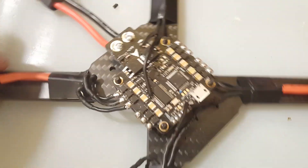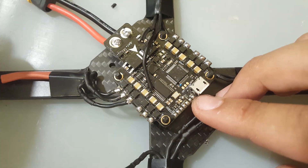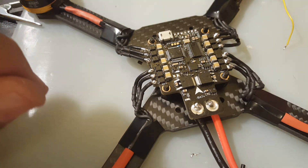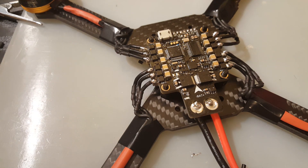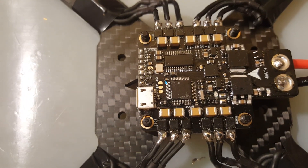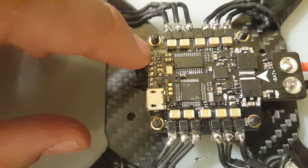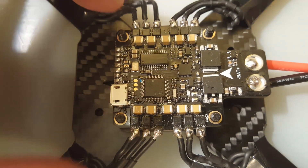I'll skip over the rest and be right back. When I come back we're going to add the camera wires, the receiver, a low-ESR capacitor, and set up the VTX wiring. Everything is now soldered on and looking clean. Starting with the camera — on the FC pads we have: ground, S.Bus, 5V for the receiver; then 5V, video out, video in, ground for video. I'll ground the camera there, ground and power the VTX from there, and the yellow video-out wire goes to the VTX.